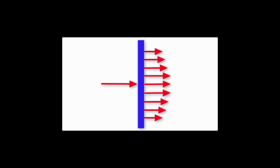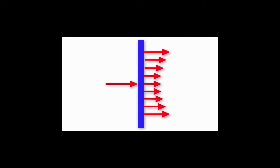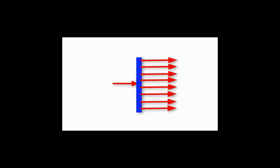Well, Tom realized that you can use this Paraline lens to create sound bubbles of many different shapes, not just the line source or section of a cylinder. You don't have to make the axis of the ellipse have a 2-to-1 ratio, and you don't even have to put the sound source in the center of the ellipse. If the ratio of the major axis to the minor axis is greater than 2-to-1, the bubble will be curved like this. If the ratio of the axis is less than 2-to-1, the bubble will look like this with some convergence. Moving the source away from the center of the ellipse produces bubbles that look like this. So, small changes to the geometry of the Paraline result in changes in the shape of the wave leaving the lens. The Paraline lens then becomes a very powerful bubble-shaping tool.